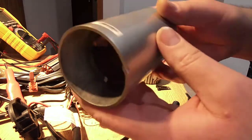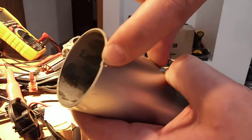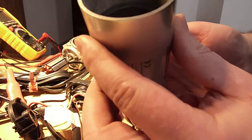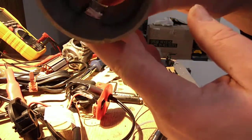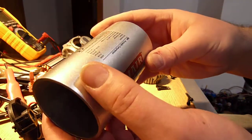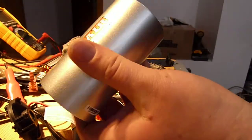Inside the shell here you've got a couple of ceramic magnets. The ends of the can are keyed so you can't orient it wrong. The magnets themselves have a couple of keepers inside there — you can see that little keeper in there that keeps the magnets oriented. They are also probably glued in, which is pretty typical. The walls on the motor shell are pretty reasonable, and the motor itself is completely independent of needing all the other structure around it, which is good.